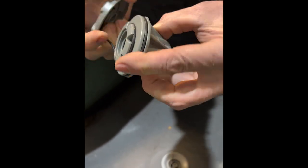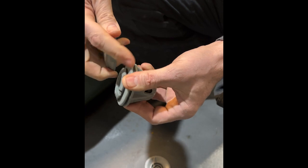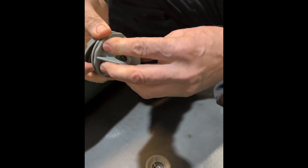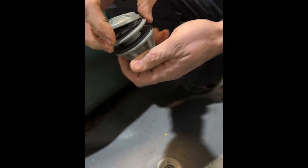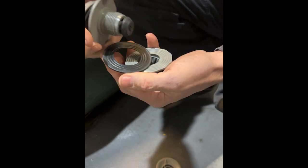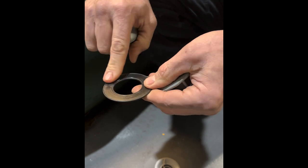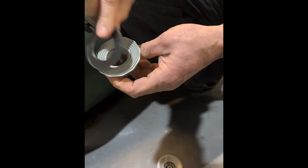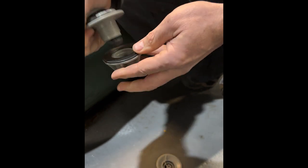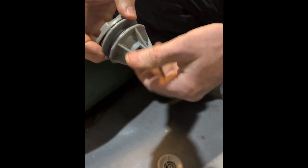Let's talk about the other style valve. This one has the lid held on with a plastic piece around the top, so there's no knot to contend with. Some valves you'll run across also have a gasket in them. This gasket has grooves on one side and is smooth on the other side — the part in the raft is grooved, so grooves go to grooves and smooth goes to smooth. Be sure you're putting that back together correctly.